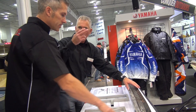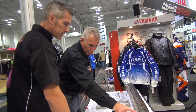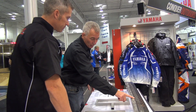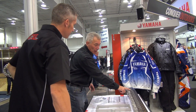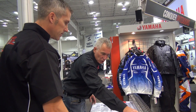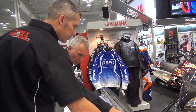If you've ever watched the track in slow motion, it's not a straight line — it undulates. Here's where it first hits the road, here's probably your first idler wheel, then you come back into the HiFax and it gets really gouged down in here again, then it comes up at the end. On the DuPont piece it's flat, straight, there's very little wear — you can see a bit more polish just past this wear mark, so there's probably a little bit going on there.